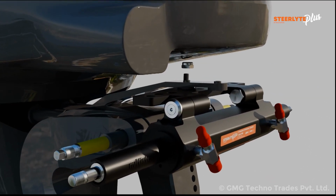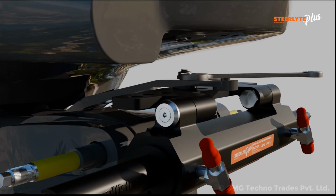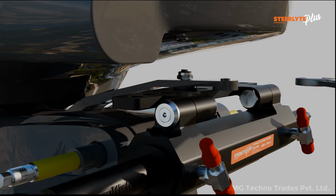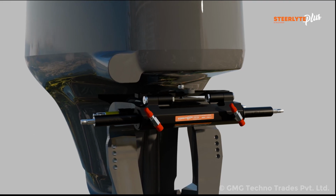Connect the tiller arm of the cylinder to the engine arm by means of the hex stud. Tighten it by using a 14 mm wrench with a torque of 20 Nm. Insert the mounting spacer, Delrin spacer big, Delrin washer small and washer. With reference to the application guide, choose the correct number of washers for the tilt tube rod.